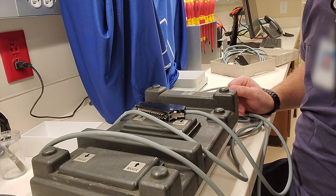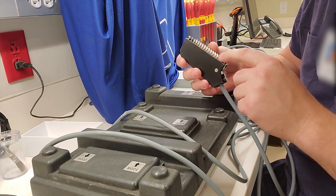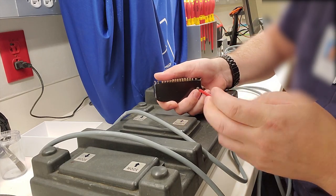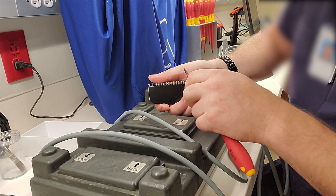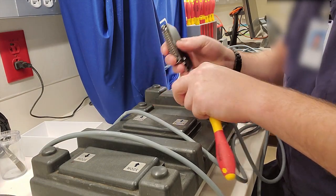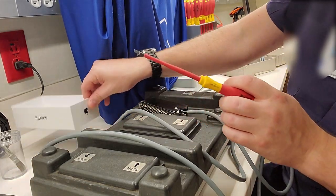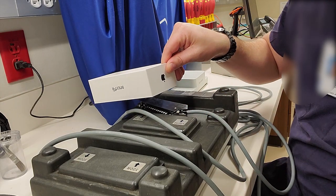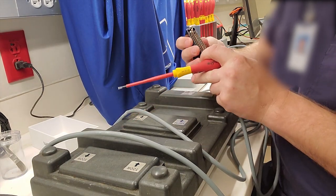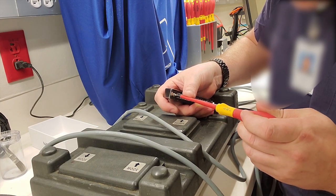The first step is to disassemble the connector and inspect it to see if there are any yanked wires. To disassemble this, there are two flathead screws around the sides. Look at that — it's coming right out. Somebody didn't use Loctite. We're going to take our fasteners as we disassemble the connector and place them in a little container — I'm going to use this Apple iPhone box.